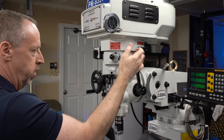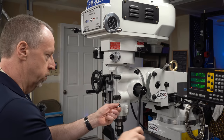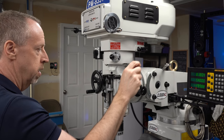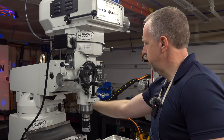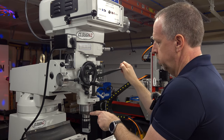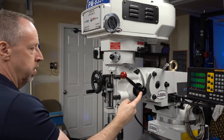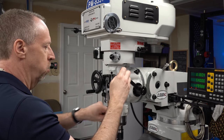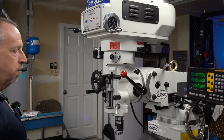This particular machine has what's called a speed handle on the quill. I can take this lever and move the quill up and down when it's unlocked. But if I lock the quill in this position, I can also move the lever out and rotate this freely without moving the quill. So if I'm in an inconvenient position, I can just unlock the handle, move it around, and now I have the lever in a more convenient position. This is an add-on — it did not come with the mill. The mill came with a lever that just has a pin you can pop in and out. These speed levers are available for pretty much every model of mill on the market.